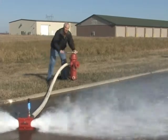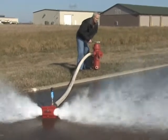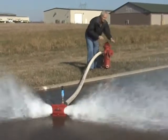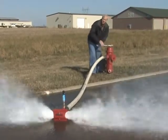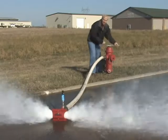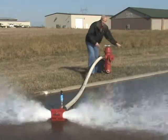So I'm going to go ahead and shut the hydrant off. This is probably the most critical part — as I start slowing this water down, I want to make sure that I'm closing this hydrant slowly and carefully so I don't cause water hammer.